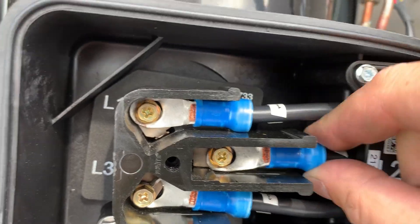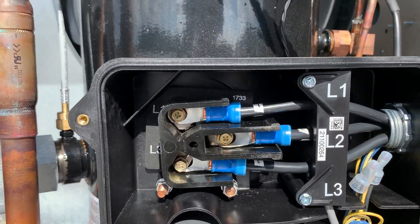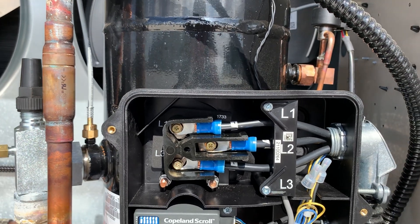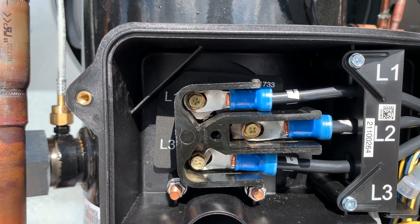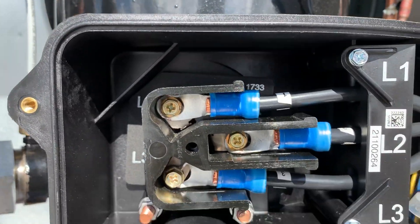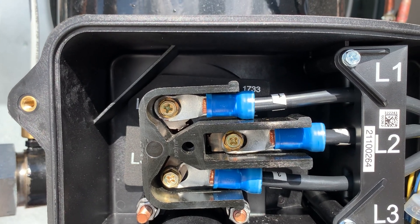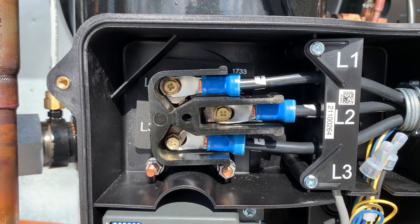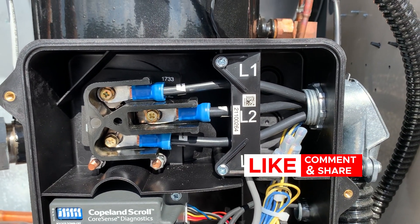I don't even know if I have parts for that. I gotta get this unit started up — this is a brand new unit, came like this. I don't have a crimper for number six wire, and I don't have crimps for number six wire, and I don't think I can get either of those in any sort of reasonable amount of time. I've also thought about getting some sort of lugs to put on these screws to terminate the wires, but I don't have those, and the thickness of any of the lugs I've ever seen is significant — the screws may not be long enough. So I got a way I'm gonna fix this in the field, and maybe some people won't agree with it or make fun of me, but that's fine. Comment below how you'd fix it, and I'll show you what I'm gonna do.